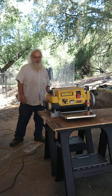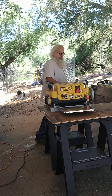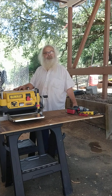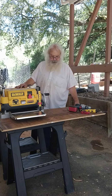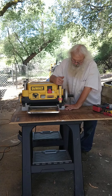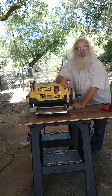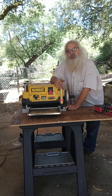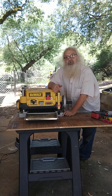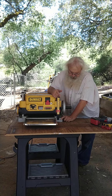Hey, my name is Edward. This is my DeWalt planer. It's never done exactly what I wanted it to do, but it works good for — if I've got a large amount of lumber that needs to be sanded, I can save a lot of time sanding by pushing this through it first. The problem I'm having with the height adjustment — it won't adjust down — is because this base plate is cast aluminum, and cast aluminum will warp if it's set on concrete. Because it's so heavy, I tend to set it on the concrete floor rather than lift it up on the shelf. So that's where I went wrong.